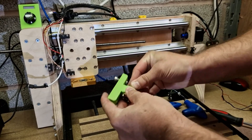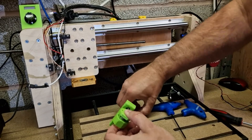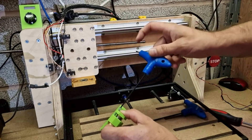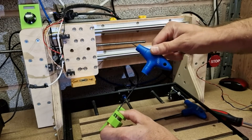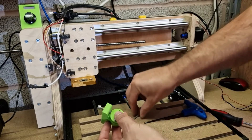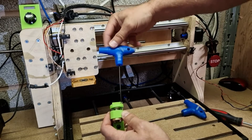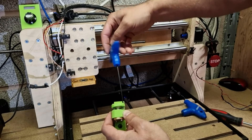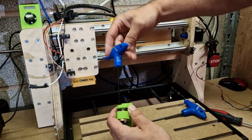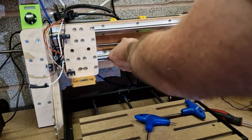You can see here I'm just using the original backlash nut, and then we're going to fit the collar over the top of it and then fit the two little retaining screws. This is going to actually compress the two nuts together onto the shaft. We can then later adjust these two screws — putting the first one in now — and that will give us a very fine adjuster to control the amount of pressure we put onto the shaft, which will ultimately remove all of the backlash. We've left the spring in there just to keep a bit of pressure against the collar. There you go, you can see that assembled, and we can simply fit that onto the shaft and adjust it up.